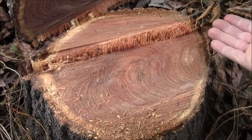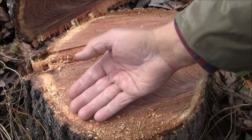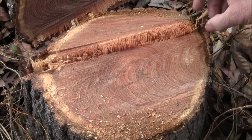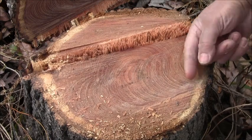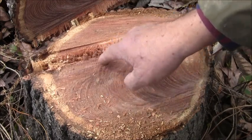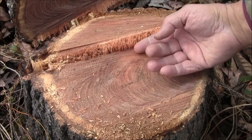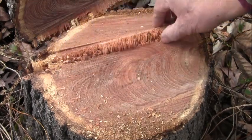Over here I start the saw like this, get it buried, rotate, push through here, then bring it up to get about an inch. I get it up to the right spot, stick the dogs in, look around it, and rotate the saw. You can see the marks where I rotate it in. The way you get that nice and straight is you hook your dog in and rotate the saw. Once you've got your width right on the hinge, all you've got to do is cut out the back on one that has forward weight.